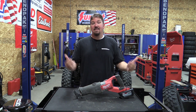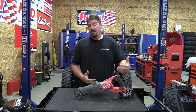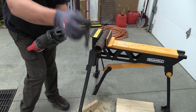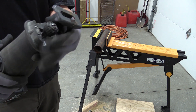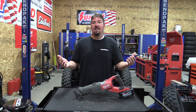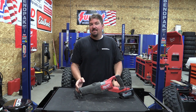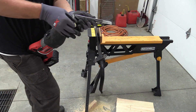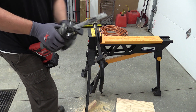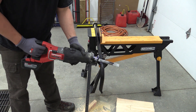This thing, 10 for 10 on everything. Now, during all this testing and blade changing, I wanted to note there is not a quick adjustment or quick blade change in the front. It is the older style shaft and quick change system. Who cares how easy it is to change the blade to a point, because you want the best system to hang on to that blade when you have this much power. Some points when this Sawzall has the system fully retracted and that shaft is all the way inside, it's a little tough to get in there and put the blade in because that spring is so tight — but you need that to hold the blade in.